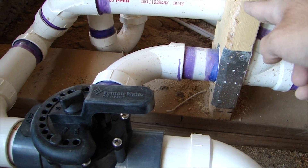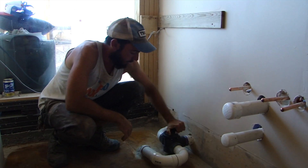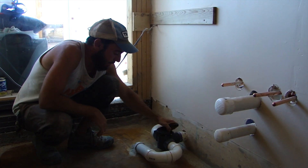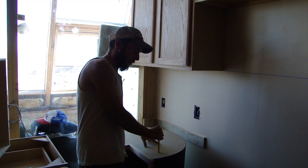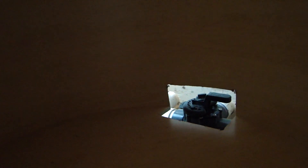All the water coming in headed for gray water — from the bathroom sink, bathroom tub, and laundry — if I just turn this valve like this, it switches to black water going to the septic. We're going to modify the lazy Susan so you can access this once the cabinets are installed. We've cut a hole in the lazy Susan; it's sitting right on top of that Jandy three-way valve, and you can see the access port in the back to switch between gray water and black water.